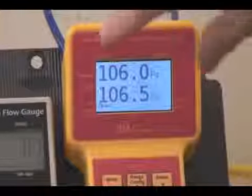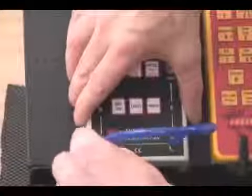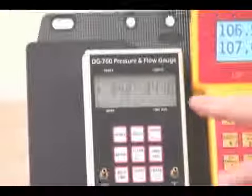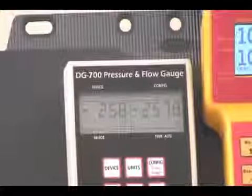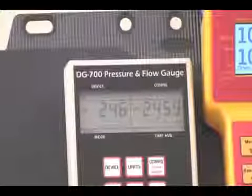So we've been able to check the gauges between the input, or the positive of channel A, the positive of channel B. We can also do a check on the negative side. So we take the tube and press it on this port, press it on this port, and we're now checking the negative side of the gauge, again at negative 300 pascals, and it will drop all the way down through the range. This is a very fast way that in a couple of minutes you can check your gauge as you're using it from day to day, and you will immediately discover whether there's a problem.